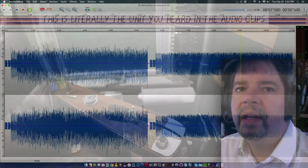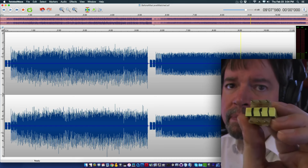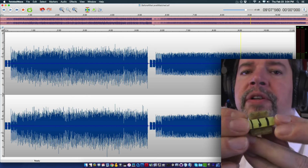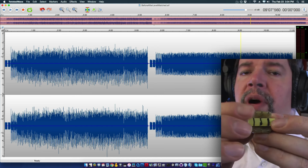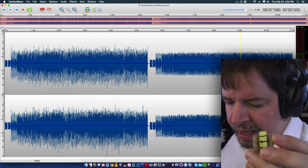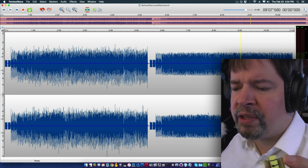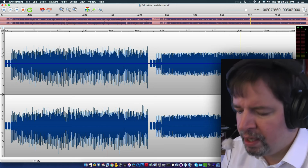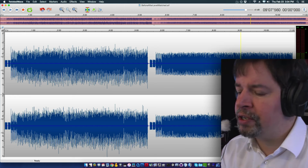Good day to you. So as you can see, I've taken a transformer much like this one with 3 wires going through it, 3 taps. And 2 of them had the crossed diodes. And then the third winding used both the diode clipper setup and a tiny capacitor. What I'm using is, I think, either 680 picofarads or 1,000 picofarads. It's a very small capacitor. And as such, it's lifting the high frequencies and also probably interacting with the diodes. But it's doing it in a pretty subtle way, just on the sort of fringes of the output.